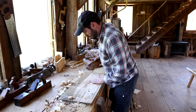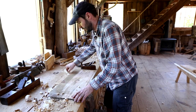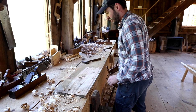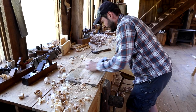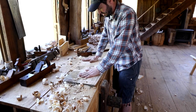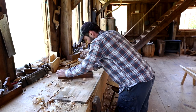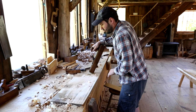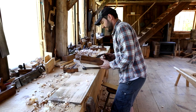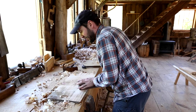Another thing we often see with period furniture are traversing marks. I've rigged up a little board here so that I can traverse the plane cross-grain, which is a way to really flatten the board across its width. Very often on secondary surfaces a board is traversed and those marks are just left — it's never taken any further than that. The fore plane will do a better job at flattening, but if you want to remove a lot of material quickly you want to set it a little deeper to bridge all those surfaces. And of course, nobody likes planing knots, but sometimes you just have to do it.